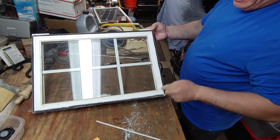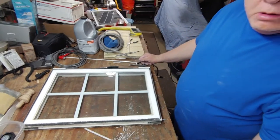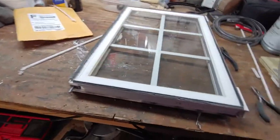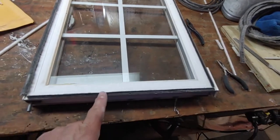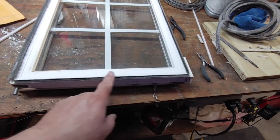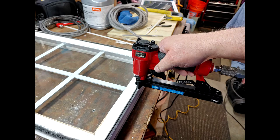Just did the whole window — this is quarter-inch all the way around, and this is half-inch on the bottom. That's the simplicity of replacing a weatherstrip. This is Big Guy DIY Robert. Hopefully that gives you an idea how to replace these fuzzy weatherstrippings inside the windows as well as the screen windows. Any questions, just drop them below. If this helped out, give me a thumbs up. I will be shooting a staple in this one as well as this one, because the window goes up and down, which means this weatherstripping will want to move at some point trying to get out. So I'm just going to drive in a small staple with a pneumatic staple gun. All right, take care everyone.